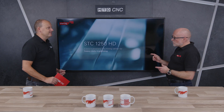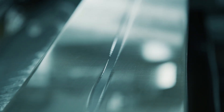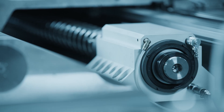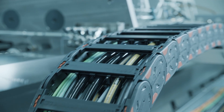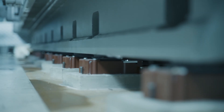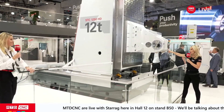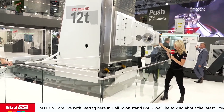And how have you done it? We've changed the linear rails for a hydrostatic system — don't get that mixed up with a simple box guideway system because they're different, and you'll see on the slide there. We've got a very advanced hydrostatic system which is basically a box guideway with an oil film between the two metallic parts. So you've got a zero-friction system, no stick-slip that you get on other types of machine. In fact, you saw Lindsay Emo pushing the whole column forward — which is 12 tonnes — with a single finger. It's a zero-friction system.